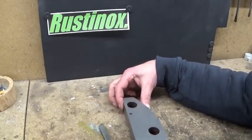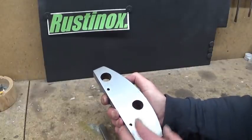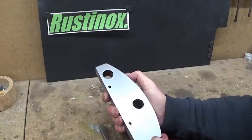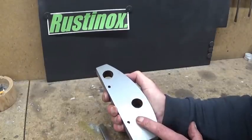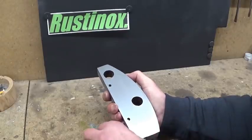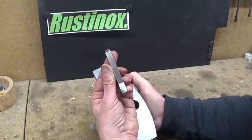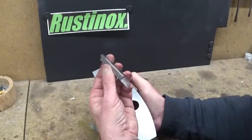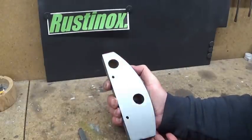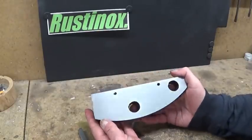The last cut you just saw is this one. The cutting speed was about 22 meters a minute, a half a millimeter deep and a step over of 1/10, and this was the cutting tool I used, the roughing tool, nothing special I suppose, and I think the finish is more than decent. I hope it shows a bit on camera, I don't know.